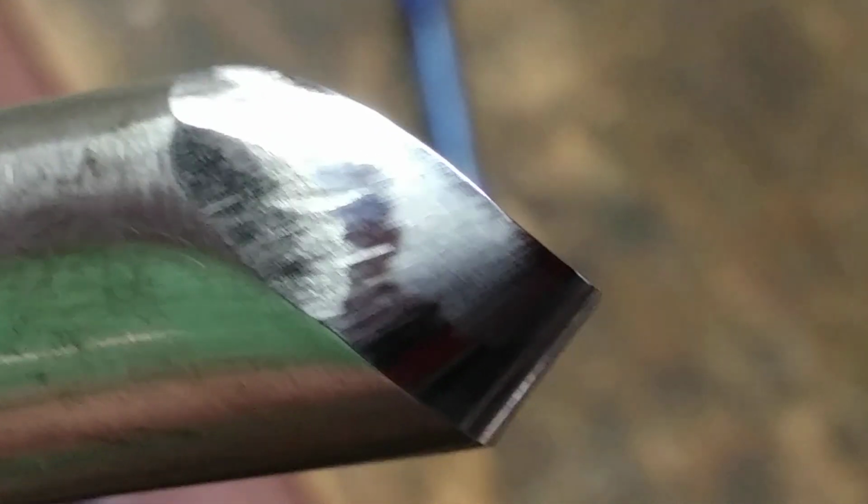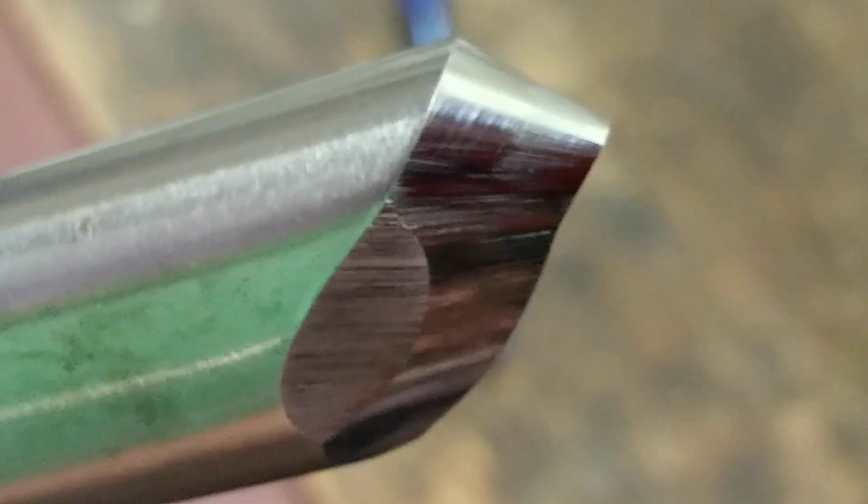So then the finished product you could look at, and you can see that we've gotten all of the ink off, which means that all parts of it touched the grinding wheel, and it did it very quickly, and it's on 1,000 grit, the grinding wheel, so it's a very little metal removed in this process, and you can see that that's just a really nice finish. Now, it's not perfect because I'm not perfect. The machine is capable of doing much better than this. I'm kind of a sloppy mess though right now, so this is how good I get it.